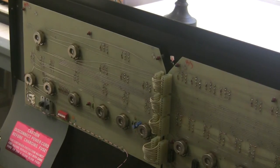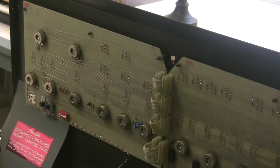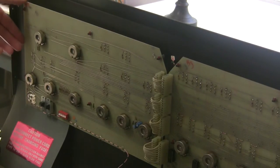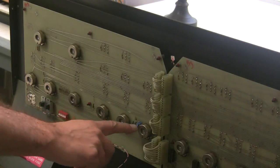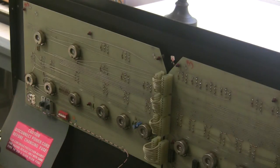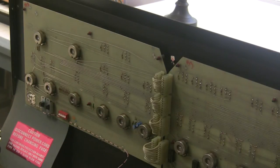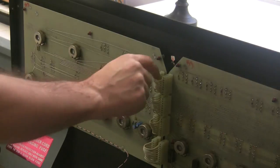Now that the power supply is back in, we're going to replace this eight-position DIP switch which allows you to disable voices — the switches get oxidized and cause problems. To do this we need to remove pot board number two. While we have that out, there are some capacitors over here — usually tantalum, though it looks like someone replaced them at some point. Internally to these boards there's a 5.6-volt rail, and these electrolytic capacitors are the smoothing capacitors for that rail. Since we're taking the board out anyway, it's very little incremental effort to replace those capacitors. To get this board out, we disconnect the connector here.